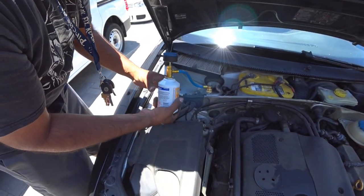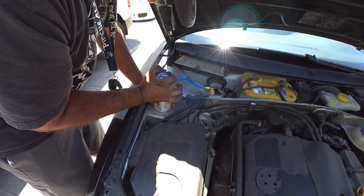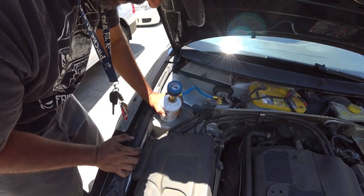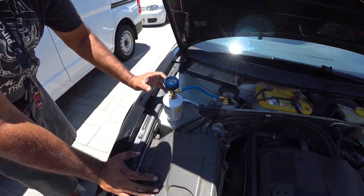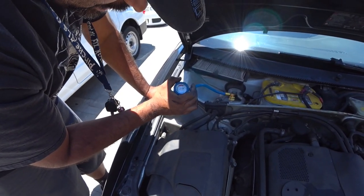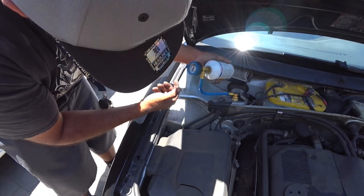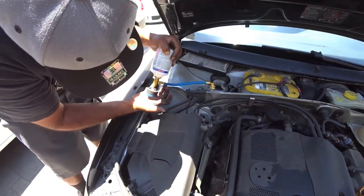What you're going to need to do is add refrigerant. The gauge will eventually start moving. Let it go — don't pump it all the way through, just pump some into it. Let it idle until it gets steady, because you'll see the needle's not all the way in yet. Then pump some more in there, a little bit at a time.